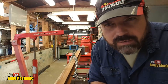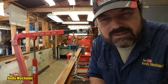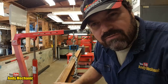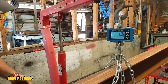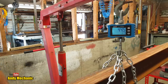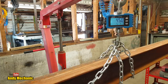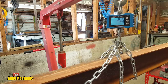I'm back now. I want to find out just how much each of these two beams weighs for the calculations. I've got the old engine hoist rigged up with the infamous crane scale. We'll see what this first beam weighs — this is the smaller of the two. We're completely airborne — 45 kilograms. That includes the weight of the chain and the mole grips, so about 45 kilograms.